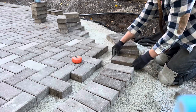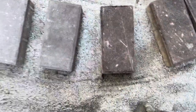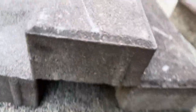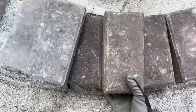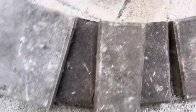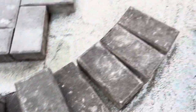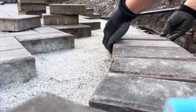I got to the point where the curve was a little too tight, so now I'm going to pull the pavers and space them out about a paver width apart at the wide end of the tight section. Then I can stack pavers on top — that'll give me a good idea of where the cuts need to go. The idea is that once the gaps get too big for the curve, we need to make some cuts. We don't want anything more than about half an inch of gap. So the curve is too tight, those gaps are going to be too big, sand is not going to stay in there, and that edge is going to be quite weak. That's why we need to add that section of cuts in there.